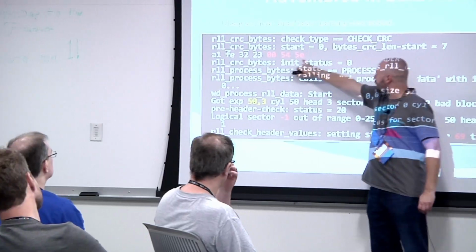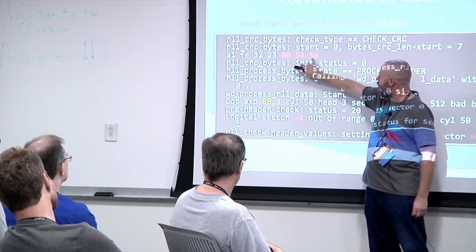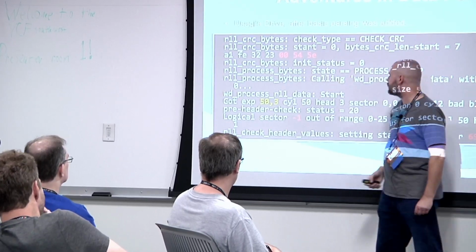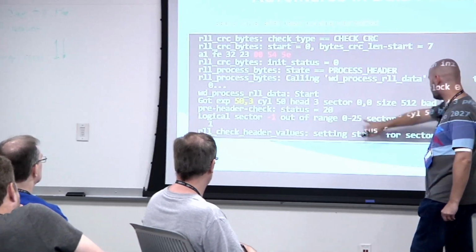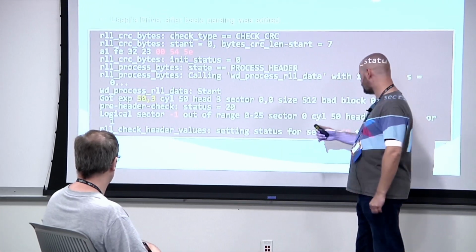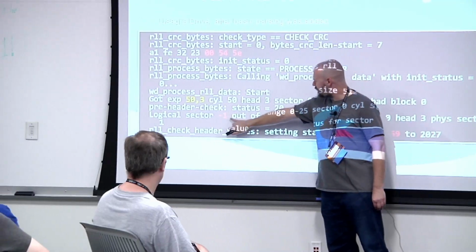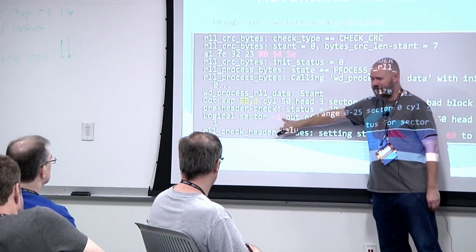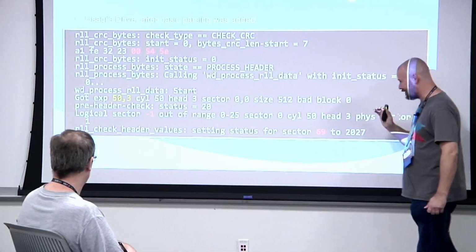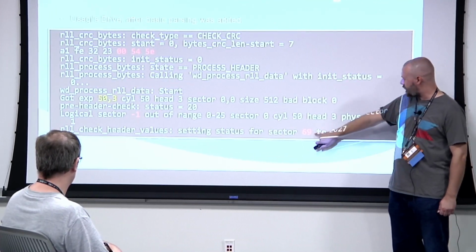these 3 bytes right here, this would be the sector number normally, and then the CRC. You'll notice that it says it's sector number 0. Again, it verifies down here, sector 0. And for some reason, still looking into it, it's saying it's sector -1, getting it off by 1 in that. Think I know, now that I'm talking through it, where in the code that's having an issue. And for some reason, later on, it thinks it's sector number 69.